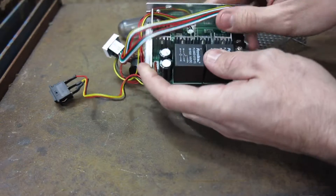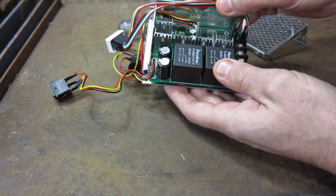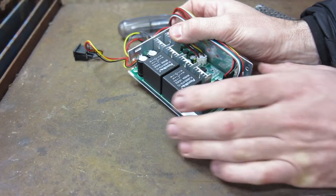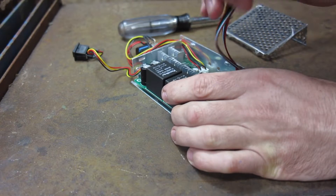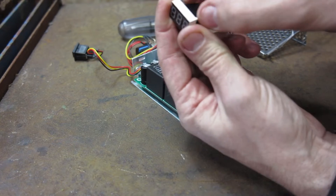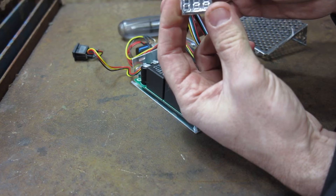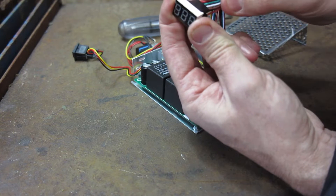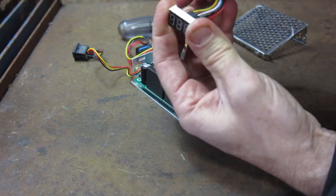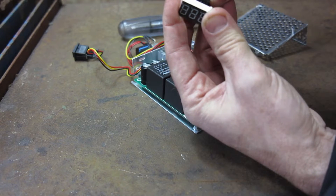Here's the unit I like using — you can see it's got big heat sinks and really big relays. One thing to note: when I hooked up the pulse width controller to the track torch I had to disconnect the wiring, and it's not really labeled well. Take a photo before disconnecting, because the terminal could be unplugged and flipped around and you wouldn't know if you got it right. Just make a note of the color orientation.